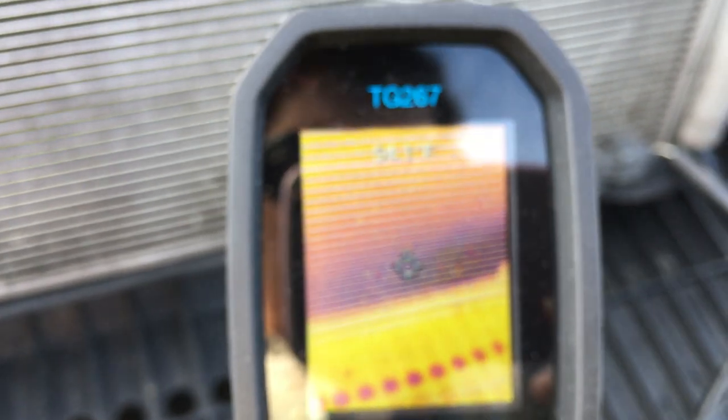This is going to be kind of hard to see, but what I'm trying to show is the dark blue shadow down below — that's the liquid refrigerant and oil at the bottom of the condenser. Unfortunately it's only 63 degrees outside right now; if it was warmer it would be a more extravagant difference. But the camera is saying 57, 56, 55, 54 degrees, which is wrong — that temperature down there is approaching 30 degrees. Because of the shiny aluminum, it's giving a false reading by taking an average.